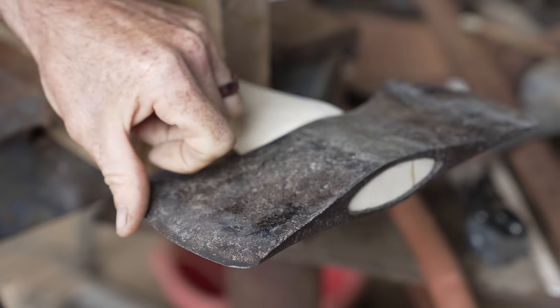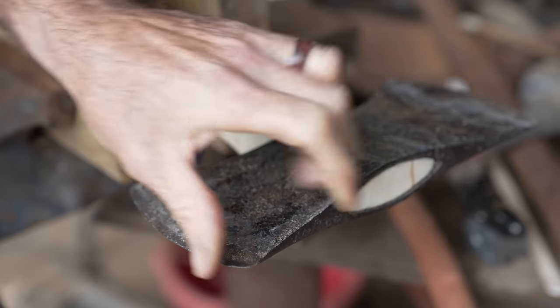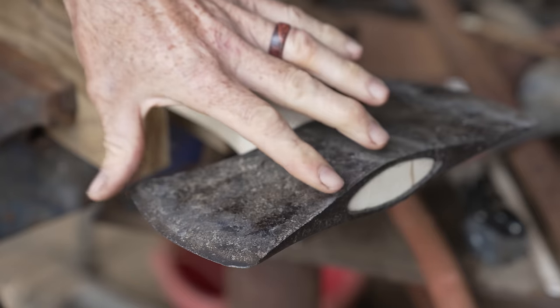I'm going to be working with a very coarse tool — this big old mill file — just to get a rough edge on it. Then, just like with any other blade sharpening, I'm going to work my way down through the coarseness until I get to a fairly fine stone. For the edge that we're going to make shave, I'm going to take it right down to 600–800 grit and eventually to a ceramic and strop, and we're going to see if we can slice through some paper. We'll start by taking some of this roughness out of the edge and putting a coarse edge on here.